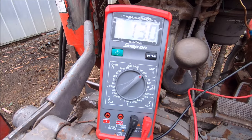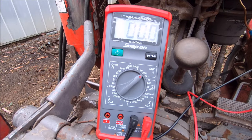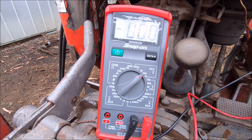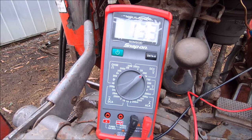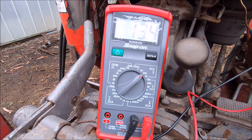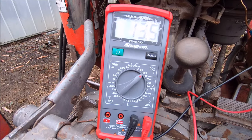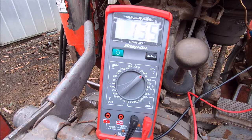When I went to start it, the battery was below 12 volts and we had to jump-start it. With it sitting now it should be a lot higher than what it actually is. I'll increase the revs of the tractor and you can see the generator does kick in — it starts charging a few extra volts. Now it goes up to 13.3, and then 13.5.